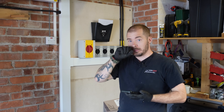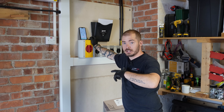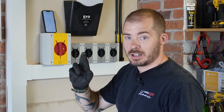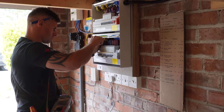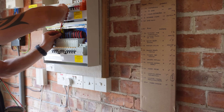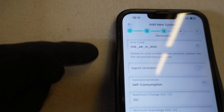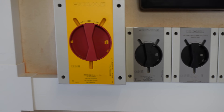By all accounts the Sig Energy is wonderful to commission and shouldn't take long — not like another brand's energy system which takes hours. Day three: we're now commissioning and it seems to be going well. If you've commissioned any other system you'll know the stresses involved, but this has been really straightforward. We connected the internet, registered the customer, and the software updates took a couple of minutes. Voltage, polarity, and all the DC and AC has been tested. There's a 7 kilowatt export limitation to set in the parameters and a DC test sheet outside — that's all been tested.